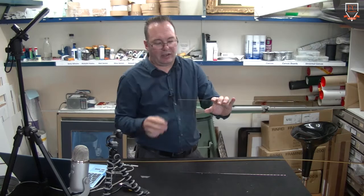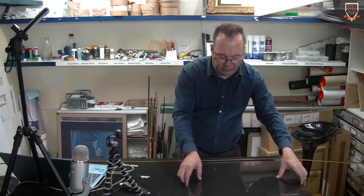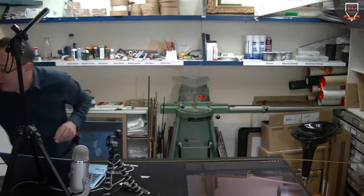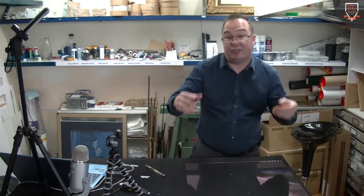With no coating on, you can't actually scratch with the blade. The side facing the camera at this stage is the side that has the coating on. So when I'm going to cut that piece, I need to cut it on the other side — I've got my film side down. In this example, I'll just do it on a table. Often we're using large vertical glass cutters.